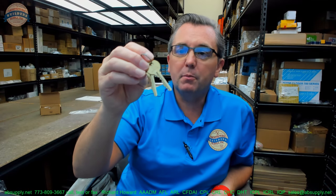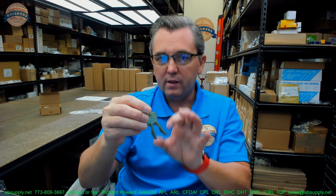This is also a simplex key — another term worth defining. Simplex means that it does not participate in a multiplex environment, meaning this keyway stands alone. You can have a set of five keyways where a key sitting on top of all five would pass all of them, making it an all-section key blank. This keyway does not participate in such an environment — it is a standalone keyway, and in fact is Yale's standard keyway.